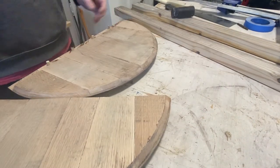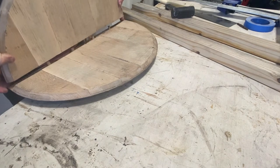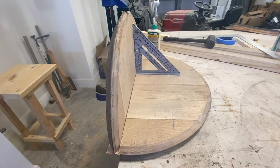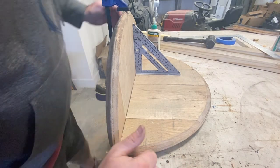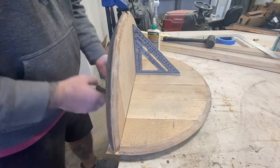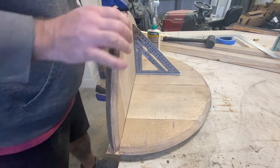When we actually join it together, we'll want to make sure that it's really 90 degrees. The best tool for this would be right angle clamps, but at the time that I made this I didn't have any, so I used my speed square and rigged up my F-clamps to hold it at a 90 degree angle until dry. I won't show you that — it's kind of embarrassing — but you get the idea.